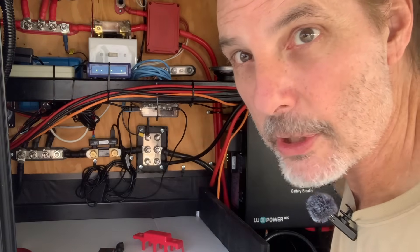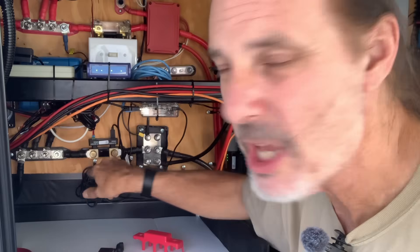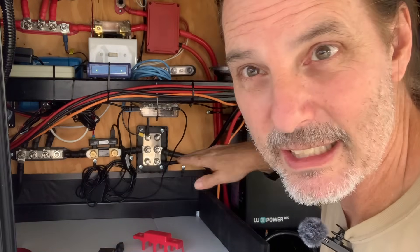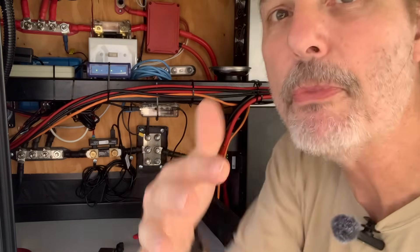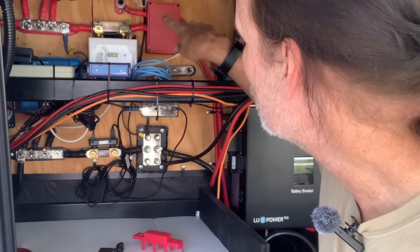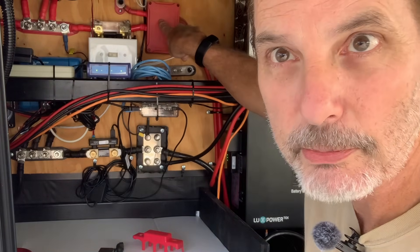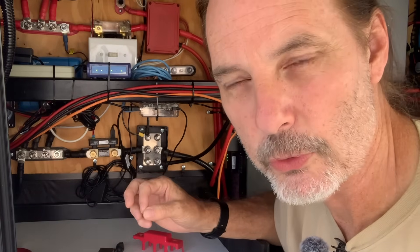In addition to temperature, it tracks the voltage of your battery directly off the shunt. This means any voltage showing up beyond this that has losses is something you should be concerned about. In other words, if my 6000XP reports a voltage lower than what the shunt reports, I know there's a bad connection somewhere — whether at the bus, the connectors, the panels, or a fuse — because that measurement comes directly from the positive bus bar and the negative coming through the shunt.